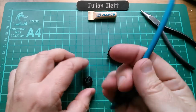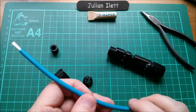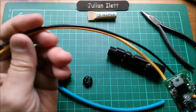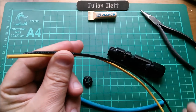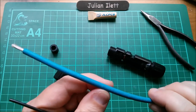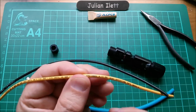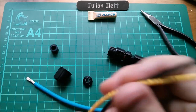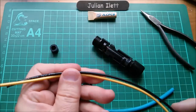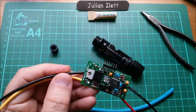There's also a plastic gripper here which is designed to be squeezed closed when the cap is screwed down over it, so this all grips the cable into the MC4 connectors. But I've got an issue because on my solar charge controller I've got these little thin cables. This one is 0.75 square millimeters, whereas the solar cable is four square millimeters. So the question is: can I put my charge controller cables into MC4 connectors to hook it up to my solar panel?